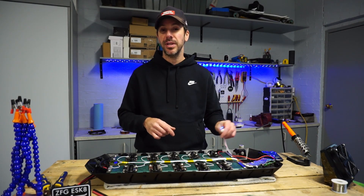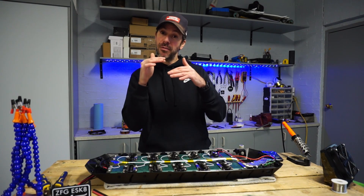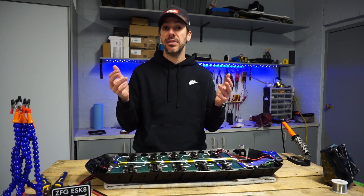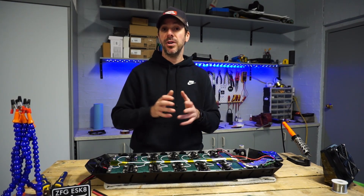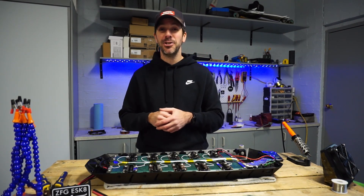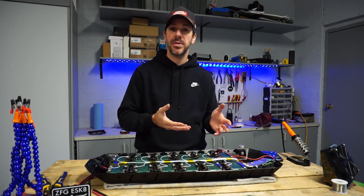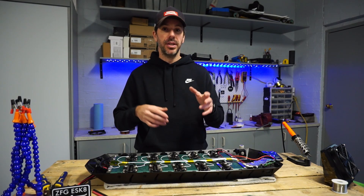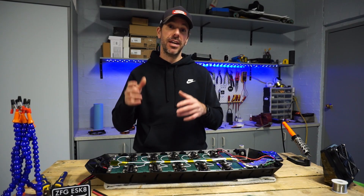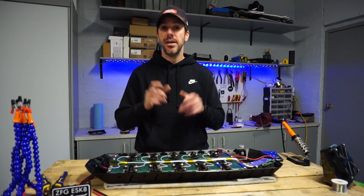When you check on your Bluetooth on the BMS, you can see that one of the P groups has hit an overcharge limit versus the rest. The BMS has done its job — it says it can't charge this anymore, it's balanced to the best of its ability, but it's going to stop right here. Just go out and ride it, plug it back in to charge, and it'll balance out again.